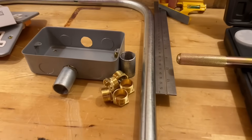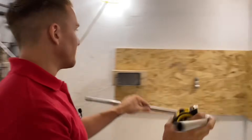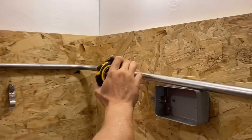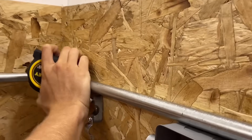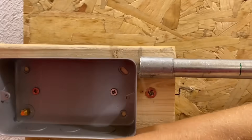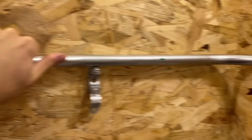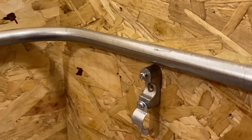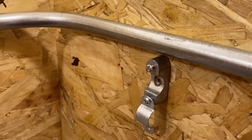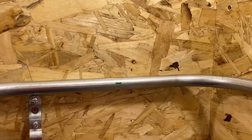I'm really happy with that. I'm going to go ahead, bring this conduit in, and offer it up to confirm it's correct — moment of truth. We're sitting against the wall. Following it round... you're a touch short — but you're forgetting the six millimeter distance we took off for the distance saddles. Bring it out six and that's going to be perfect.